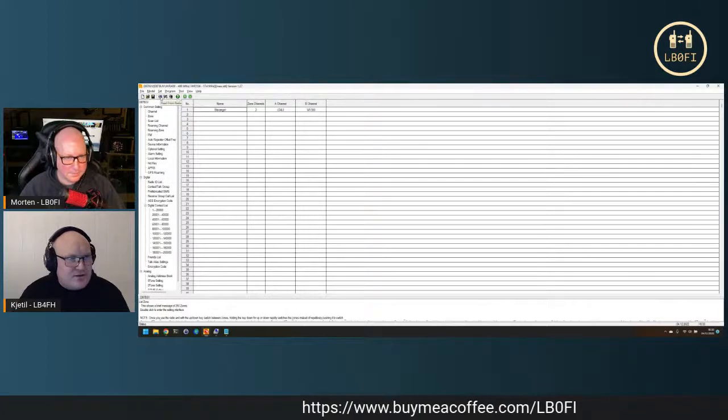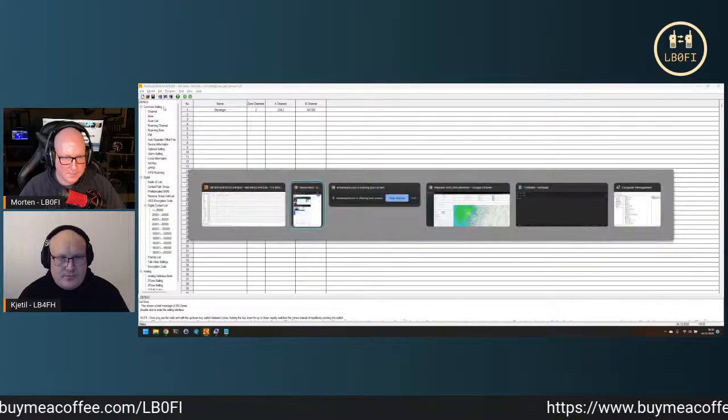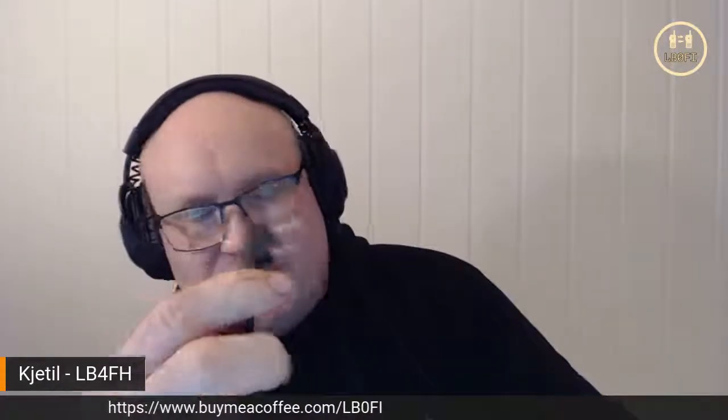So if I would like to burn this to the radio, firstly, I'm not sure if you can focus on my camera. Let's see if I can get just you up here. That was the wrong one. Yep, like that. So as with most of these Chinese radios, they use the Kenwood plug for programming. It's not the same as you would find for the GD77 or for any Baofeng radios. It's the same plug, but it's a non-compatible device, which is typical for them. So I have 3 of these ones, and none of them work with each other. So just plug it in. It fits one way because you have one small and one thin.